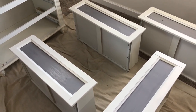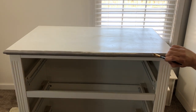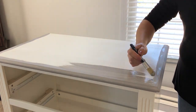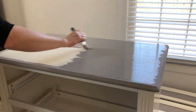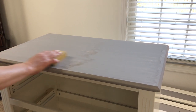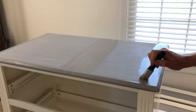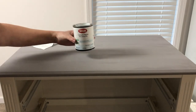While the drawers are drying I can go and start working on the top of the dresser, which I'm going to paint with the same gray paint. I'm starting off by going around the outside edging with that detailed angled brush, taking my time. Because this is a smooth MDF surface, if you happen to get chalk paint somewhere you shouldn't, you can always take a wet baby wipe and wipe it right off while the paint is still wet. Using a chalk brush I'm going to apply the first coat all going in the same direction and allow that to thoroughly dry. Once it has dried I'll take my sanding block, go over the entire top, wipe everything down and remove the sanding dust. The second coat I'll apply in the opposite direction so it gives me a nice almost fabric-like pattern with the two different brush strokes, then I'll sand it smooth again and remove the sanding dust.